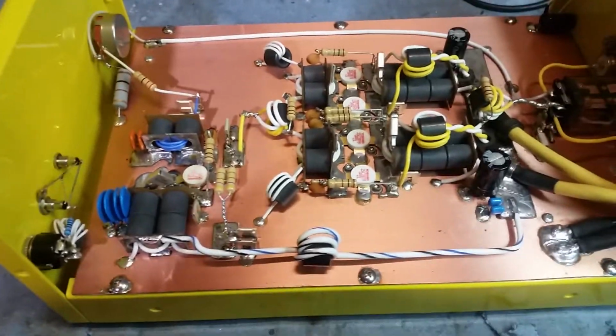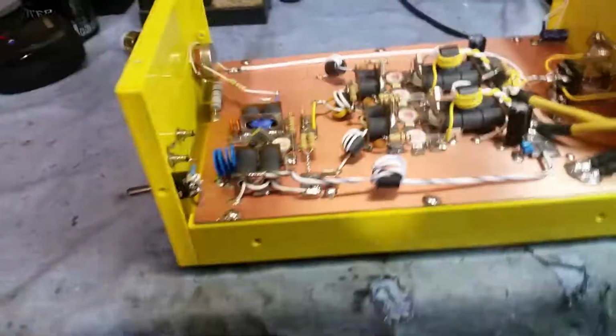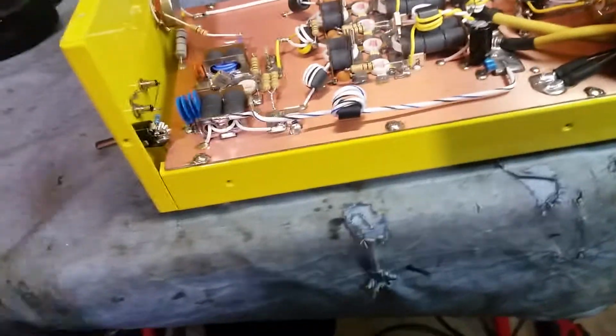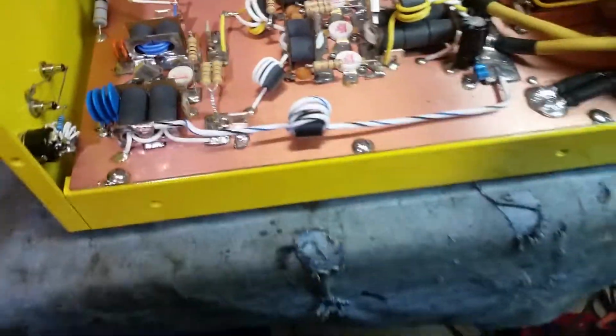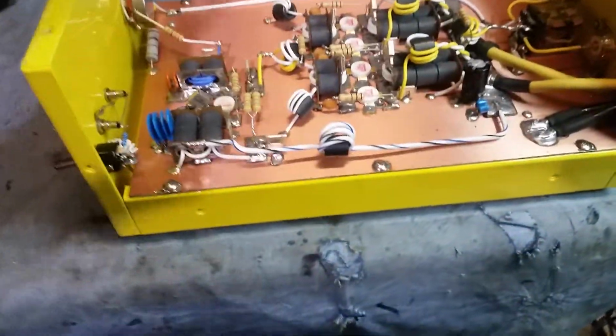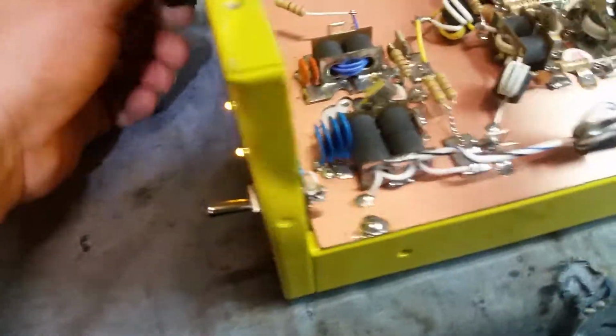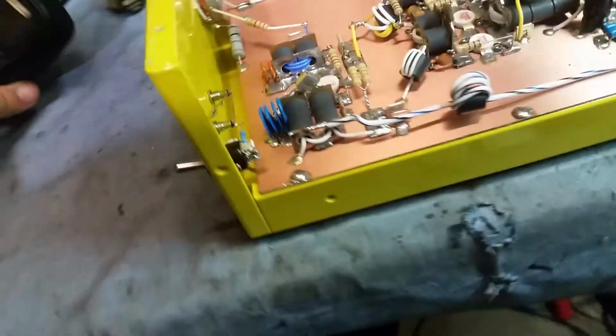So there you go. All right, bud, we're going to use the 4-watt radio first, the bench radio, which does about 4 watts RMS, and about 16 to 20 peak, somewhere around there. This does have a 2879 driver in it, so it makes it a mid-fi, mid-drive box in a sense. It takes a little more drive to get that 2879 rocking, and I'm a big fan of the 1x4s with all 2879s. So we're just going to leave the variable all the way up. All right, 1000 watt slug.